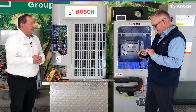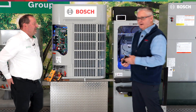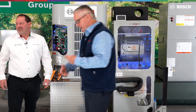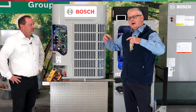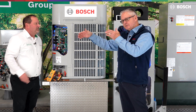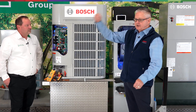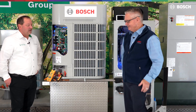Let me see if I can find a dollar. You got a dollar? I do not have a dollar. Who's got a dollar at this place? We got a guy here — thank you, Dave. Always have a bank with you wherever you go. So literally what we're doing with the COP: if Chris is my power supply company, I give him a dollar. With that dollar spent, he's going to give me a dollar's worth of power, and I get to turn this unit on at a COP of 2.1 or 2.2. I'm paying a dollar and getting two dollars back out of that one. That's a really good payback — boom — at five degrees!